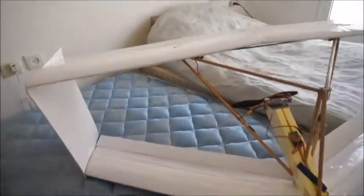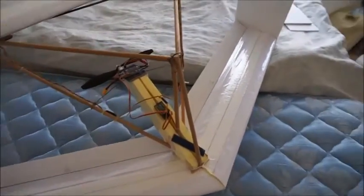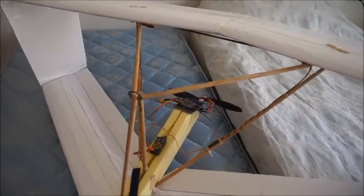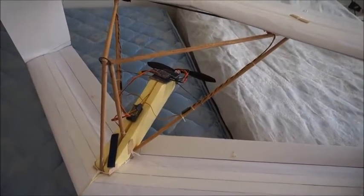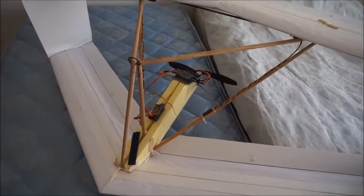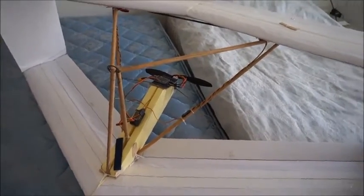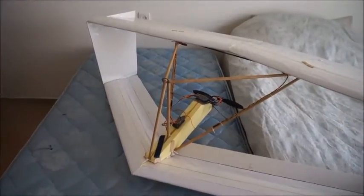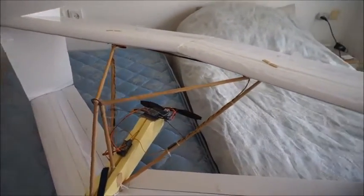This thing needed a lot of bracing. The wooden cage is a tetrahedron — I can think of it as a pyramid. Triangular vertices always give a much stronger structure than square, which is why you see triangular structures in all kinds of trusses on bridges and things like that.